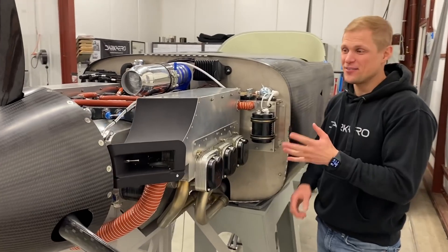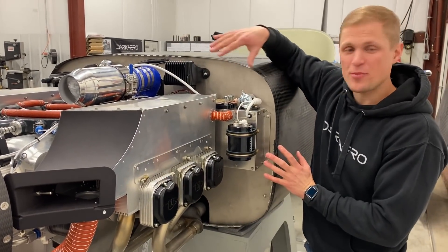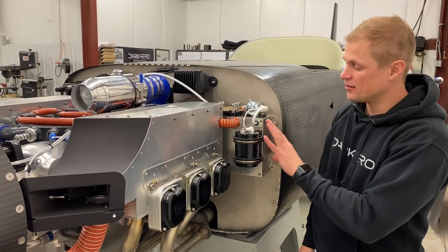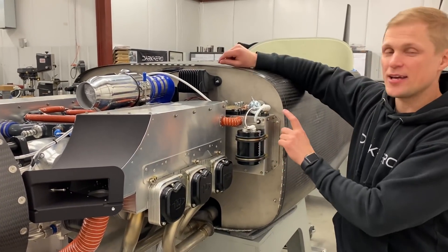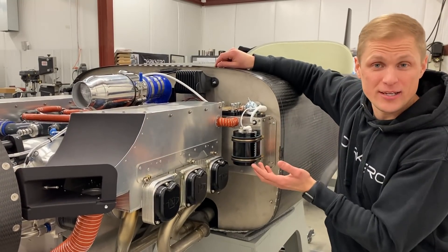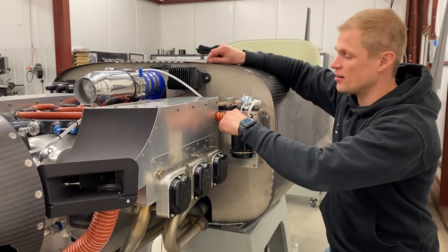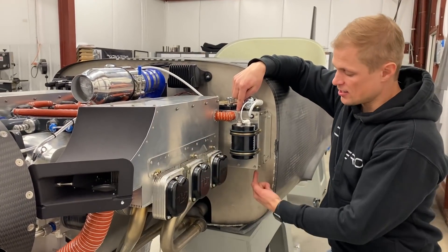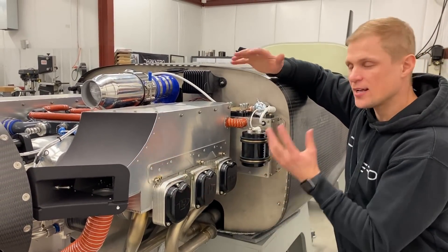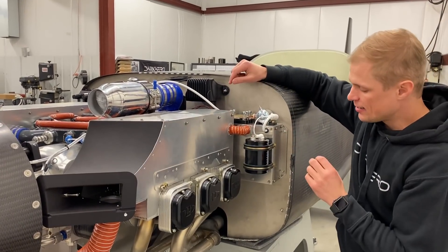We're at the front end of the aircraft — this is the Firewall Forward, which is the big section I've been working on lately. I've been focusing on the pilot side, finishing up the battery box. There's a lithium battery underneath this aluminum enclosure, and what we're doing here is actively cooling the battery so that heat from the engine and exhaust doesn't send the battery outside its operating temperature limits. Air comes in through the big plenum to cool the engine, and we're bleeding off just a little bit of air through the scat duct into the battery box. There are a couple of exits on the bottom of the box to allow air to flow in over the battery and then out. We're just making a little air curtain over the battery.